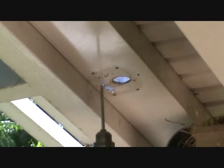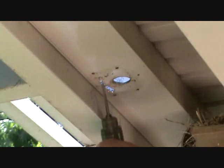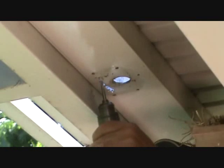Okay, keep drilling them fairly close together, not too far apart. Okay, and that'll make it easier to cut these on the side with the drill. You're just using the drill as a cutter. Okay, keep her going all the way around. You'll get her little by little.